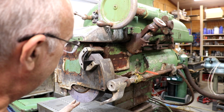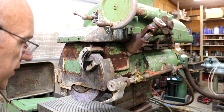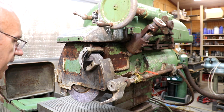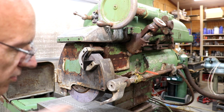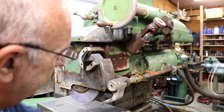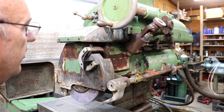These Thompson grinders are a little bit different than a lot of surface grinders. You've got the chuck, of course, that's moving back and forth underneath it. The chuck stays stationary other than the left and right movement. On a lot of them, the table will move in and out as well as left and right. This one, the table only moves left and right. And the whole head up here is on a set of ways that hang from above, and it moves back and forth. So the stone is moving across the work rather than the work moving under the stone.